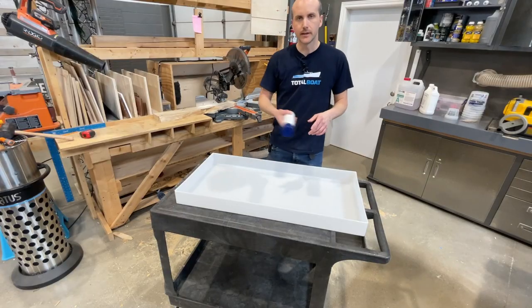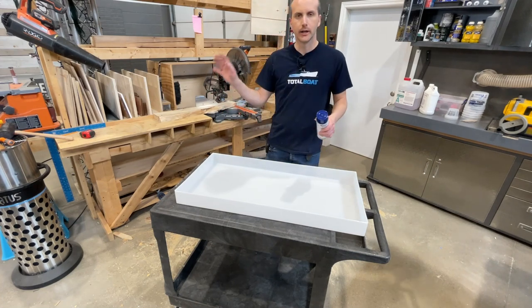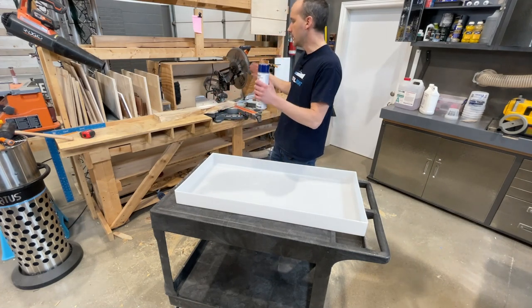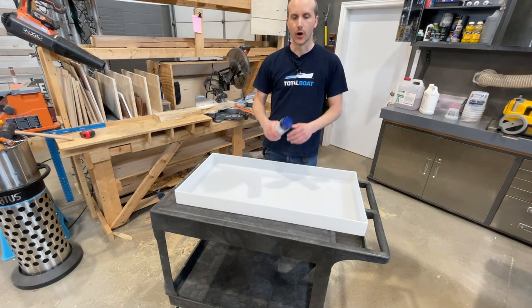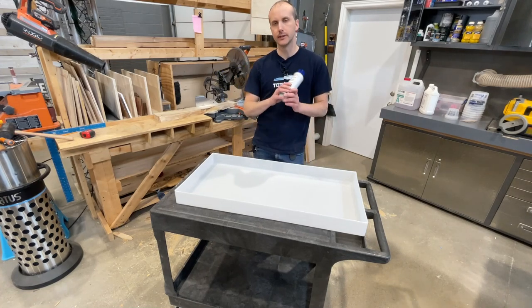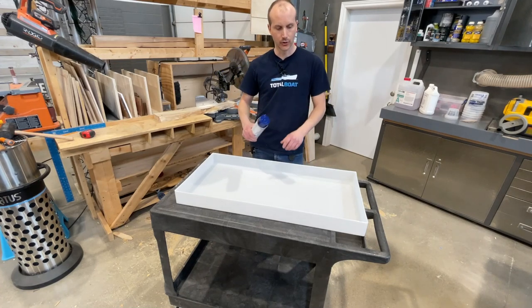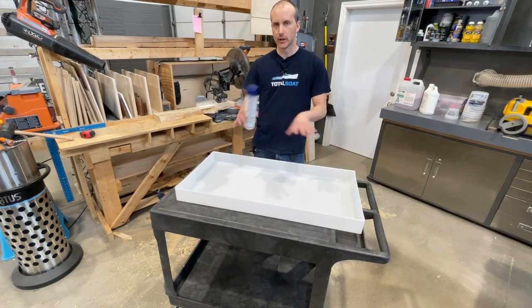In the last 10 or 15 minutes I've prepared that slab — cut the wood, shaved off the bark, gave it a quick sand, and made sure the wood was long enough to fit snugly in our mold. The next thing I want to talk about is mold release. In silicone molds you definitely do need a mold release, a non-silicone based mold release. In these HDPE molds, however, a mold release is strictly optional.